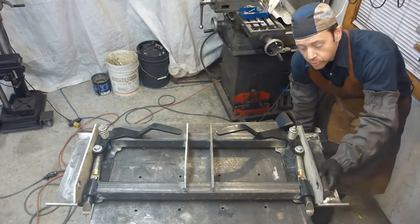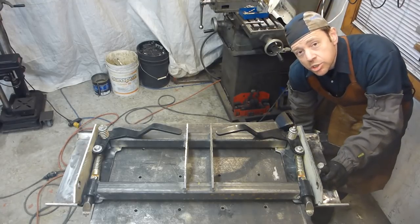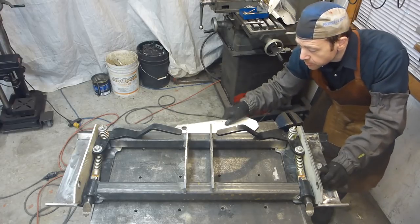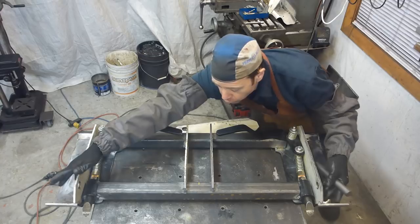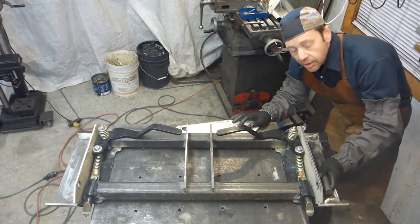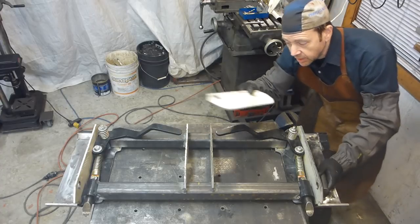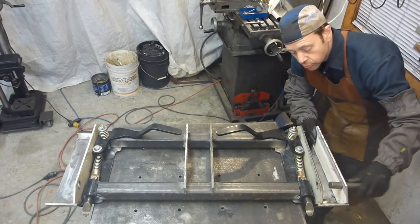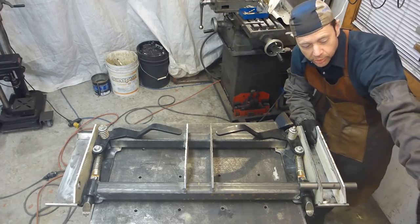Okay, next thing is to assemble. This is the inner side of the frame, which allows us to make some trials on the tractor. This is the center for the curl cylinder, and this is for the loader arms. Next thing we'll do is to put those duplicates on the sides. We're going also to make sure that we align the pin, and we're going to have the bushings.